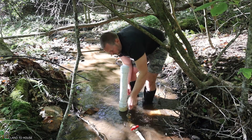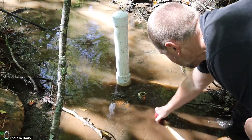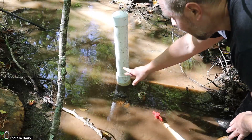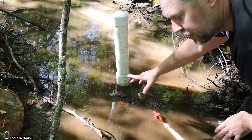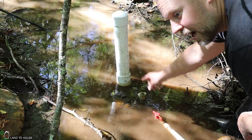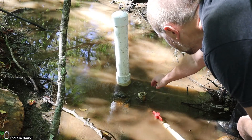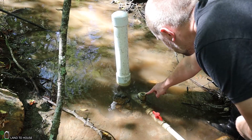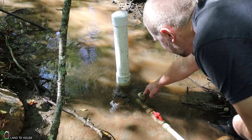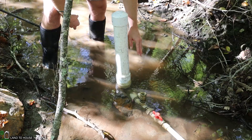Now it's time to get the pump up and running again. In order to start the pump I'm going to turn on the drive pipe — water will splash out the waste valve and I need to press this a few times. I've already got my delivery pipe full so it should not take much, but if you don't have your delivery pipe full you have to push this a lot of times — sometimes over a hundred times before it's full and ready to go. When the weight of the flap starts getting lighter you know you're getting closer to having the pump running on its own.